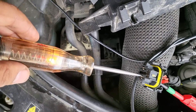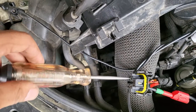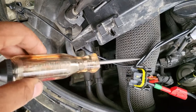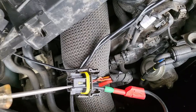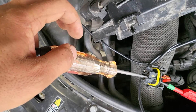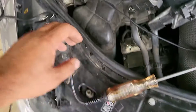I'm on negative, and on the right side — the brown wire — we have a positive. Make sure the ground is not shorted to battery voltage, which it's not. The other two small ones — the red and green — you have power. This one comes from the fuse box, and the last one — the red and black — I had blinking. The test light was blinking the whole time.